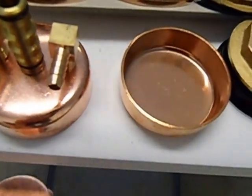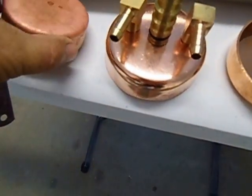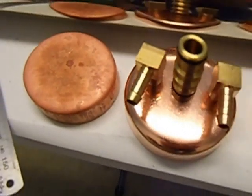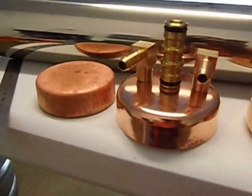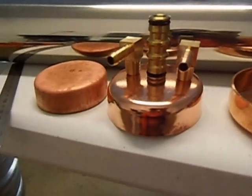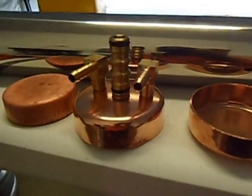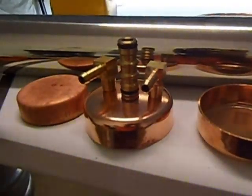This is going to be at the bottom, sort of just to catch the vapours that come up directly underneath the coil — actually it's going to be on top of the coil. So the vapours are going to catch onto the coil and recondense. The vapours that come up will be alcohol boiling at about 78 to 79 degrees, catching onto the coil which is at about 60 degrees, and that will cause it to condense and drop down onto the ceramic ferrules.